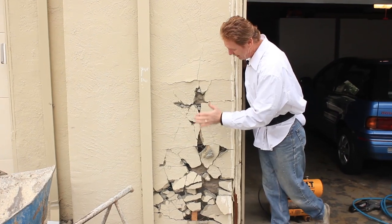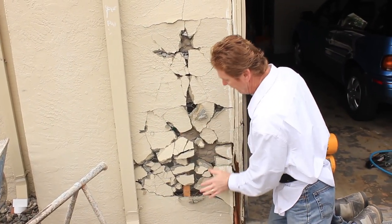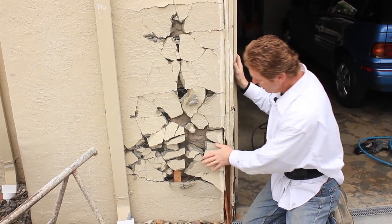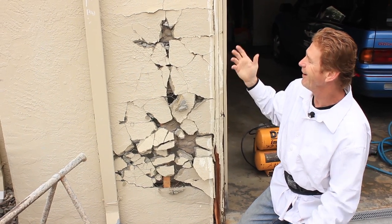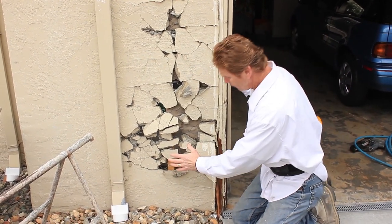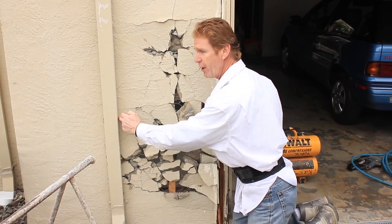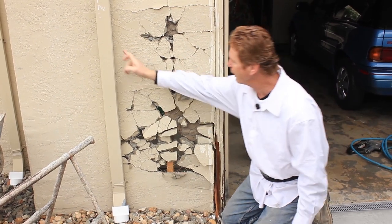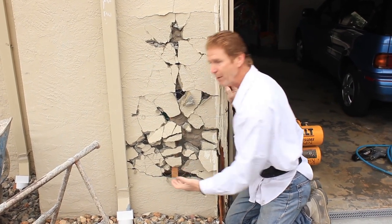The fellow who hit the wall said, Kirk, I've seen some of your stuff — can't you just nail this in and plaster right over it? And I said, absolutely I could, but will I? No, that's not how we do things, because we'd have no waterproofing barrier. It's like being in a race and you think you're not gonna win and you just quit. I always say give it your best shot. I told him it'd have no waterproofing capabilities if we just spread over it. He said, well, you're going to take it to this stud and you can't even guarantee it. And I thought, yeah, but at least, like in that race, I'm gonna give it my best shot. I'm not gonna give up. If we take it to the stud, we can put all new paper here, and it's better than just putting cement over it and having paint as a band-aid.